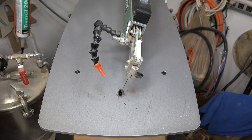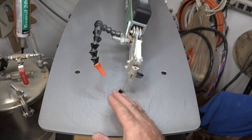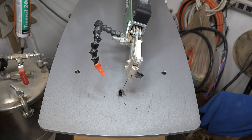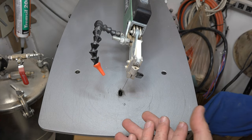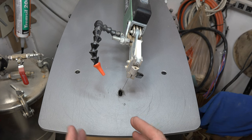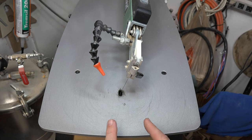Now at the scroll saw — with my Excalibur it's the motor and blade that tilt while the table stays square — you want to tilt it to the same degree of angle as what you cut your wedges, in my case a little over 18 degrees. We're going to cut the semicircle out that we marked on the wedge. Whether you cut counterclockwise or clockwise depends on your setup: if your table tilts one way you cut counterclockwise, the other way you do clockwise. When done, with the 90-degree surface down to the table, the semicircle will be wider at the bottom than at the top.